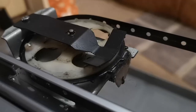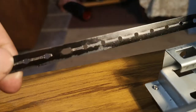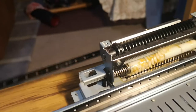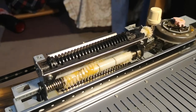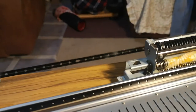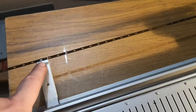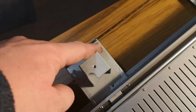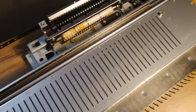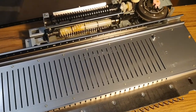I need to clean all the grease and grime off there and re-grease. It's not looking too bad — I would like to replace that quite soon. That's the belt that moves the punch card. As you can see, the punch card moves and selects there when you move it. I've got a carriage to clean there in a minute. There's the bottom of the machine that I've taken off. How did I get the bottom of the machine off? On the top of each one of these struts that comes out from the machine, there are some screws that need taking off at those points. There are also some screws underneath that hold where the clamps go, and then you can get to the bottom of the machine.